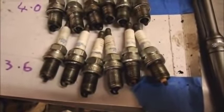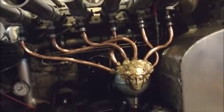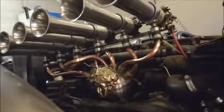But the point is, both of these engines have a similar series of copper pipes, which I was assuming, I bet I can show you, I was assuming that because these copper pipes are all different lengths, I might be getting different mixtures in the cylinders. But if you look at those pipes, back engine, those pipes, front engine, they're all comparable, twisty, some are shorter than others, etc. But it looks like the front engine is getting a relatively even mixture. So this means I might not have to do a separate valve adjustability module on each pipe, so I can adjust each one separately. I might be able to get the engines to run evenly without any of that malarkey at all.